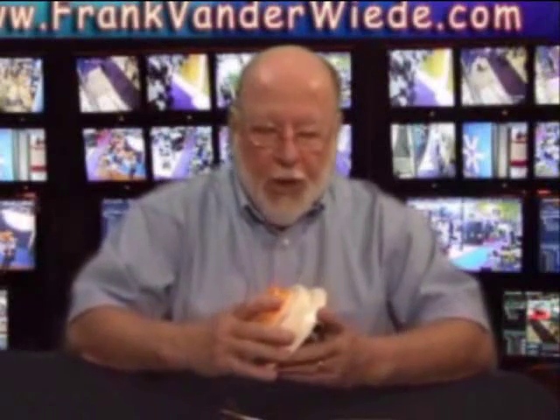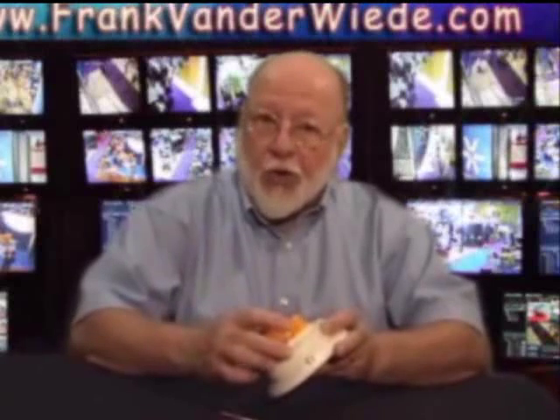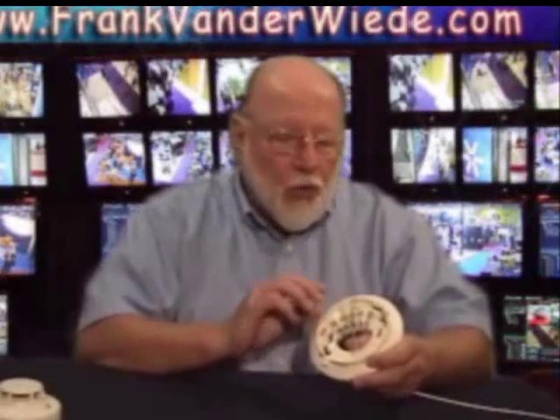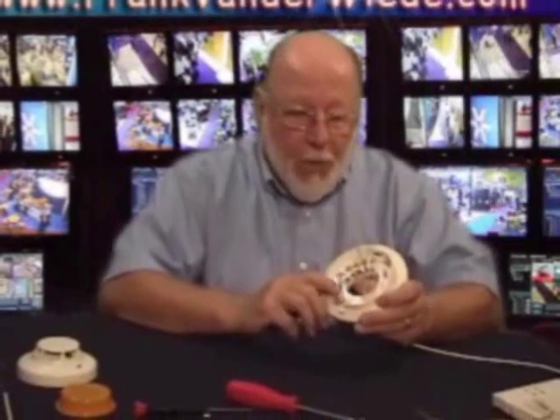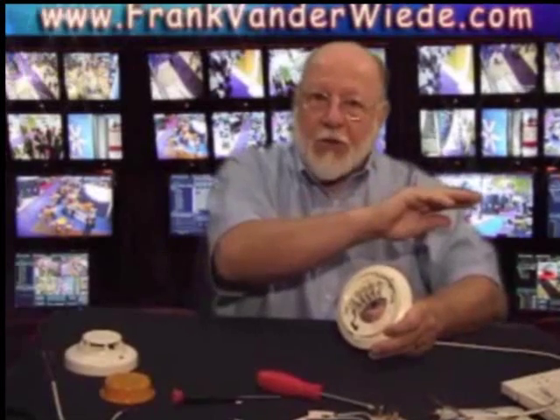Our last device will be the smoke detector. Smoke detectors come with a little plastic cover — keep the cover on until you're ready to power up the system. This do-it-yourself kit uses a four wire smoke detector. Your wiring will go directly to the base plate. You'll notice the screws are labeled plus, plus, minus, NO, and C. NO is new — the reason for that is that this is a normally open device. Everything else is a normally closed device. A normally open sensor does not require series wiring. If you have more than one smoke detector, you can go from your control panel to the first detector, from this detector to the next detector, and so on.